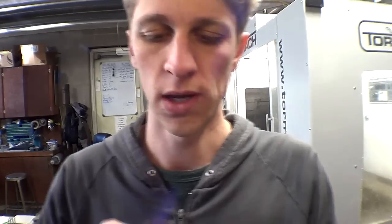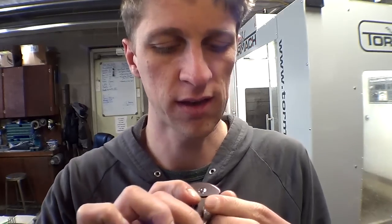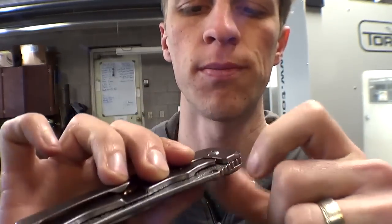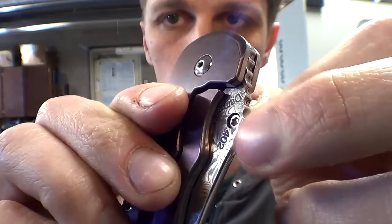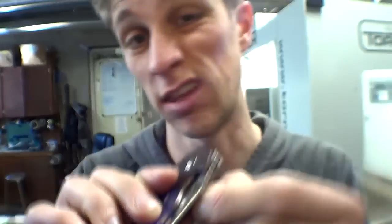However, I made a little tiny mistake on it. When I was doing this hole for the thumb stud — for the screw head — I think I had a tool offset wrong or something, and this happened on, I think, two blades. So when I put the screw head in, it goes in too far. The screw head should be flush right there, but it's sunk down about 30 thousandths of an inch. Not the end of the world, but also not ideal. How do we fix this?